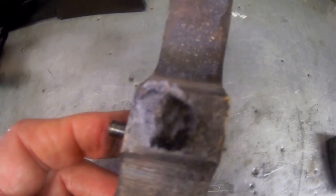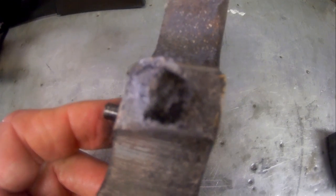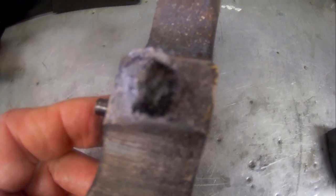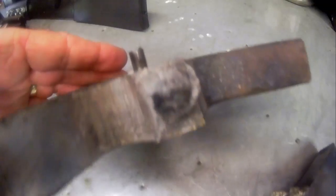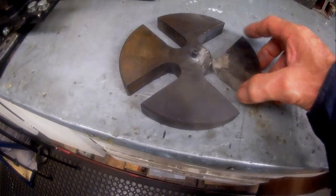I would suggest that the problem there was that I did not get the body of the die plate hot enough to ensure that the bronze fused with the cast iron. Secondly, I should have made sure the groove on the second side went down into the braze joint on the first side. There's quite a gap there between the two braze joints.